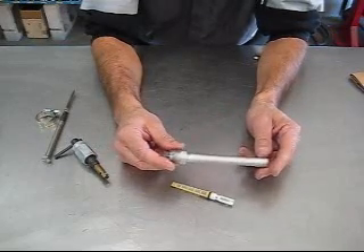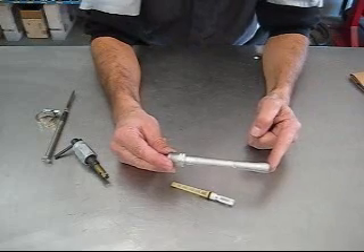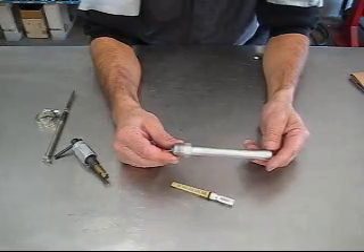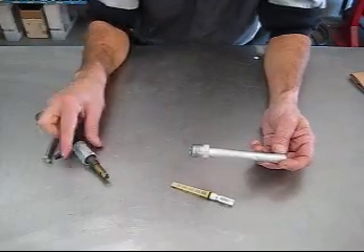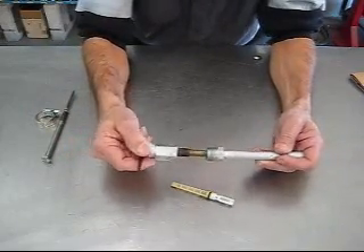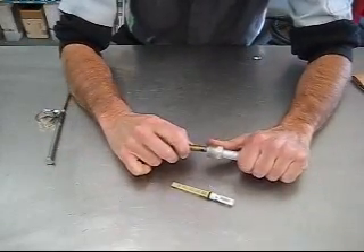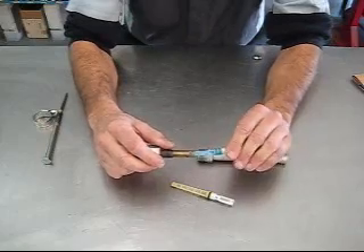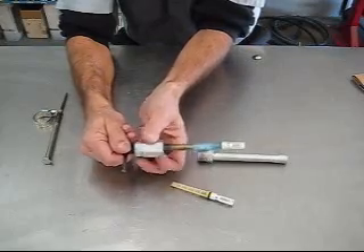To get one out — this is another thing we see a lot — people will break them off and get them stuck. In some cases, you end up having to replace an evaporator, condenser, or a liquid line. But if you're careful, you can get 95% of them out. You can start with needle nose pliers to pull them out, or we actually offer an actual extractor tool, which goes down, hooks on those tabs, and allows you to pull the tube out, as it latches on there.